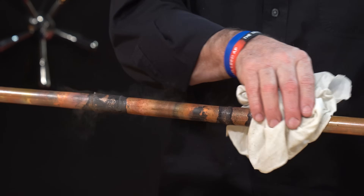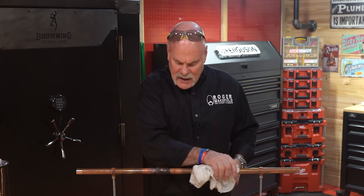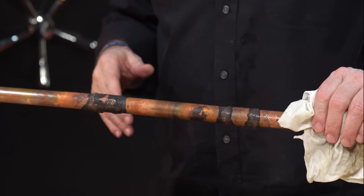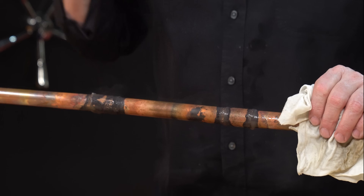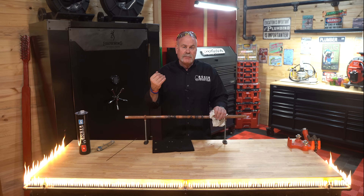I could have also got a brazing tip out and gone a little slower, but when you're out in the field making 100 or 200 braze joints a day — like when we were in scissor lifts with oxygen-acetylene bottles strapped in, doing joints up in a 20 or 30-foot ceiling — you're just trying to get as many done as you can in a day. There are going to be people who criticize the way that I braze — say I get it too hot, that I capped it, this or that. But this is the way I was taught to braze and I don't have leaks. So you tell me what you think, good, bad, or ugly. The good thing is now you know the difference between a TurboTorch and a Rosebud. If you liked this video, you're definitely going to like the next one.